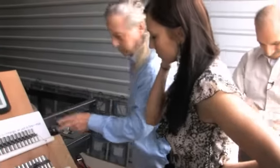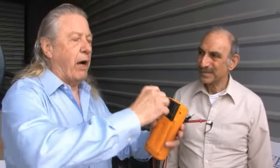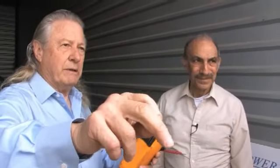There's a law called Kirchhoff's law. The second law says that if you have loads in a system, you'll have a voltage drop across each one of them. But if you add up all the voltage drops across the system, it will equal the input voltage. In fact, when they write out the equation, it says the difference between the input voltage and the voltage drops across the system is zero, meaning it won't be a difference. You can't get a difference.